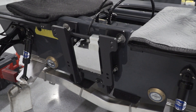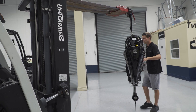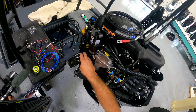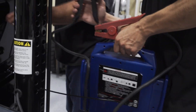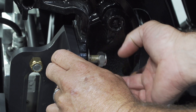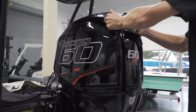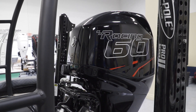Me and Brian will be installing a 60R Mercury onto this 16-foot skimmer skiff — should be a simple install and it's going to let this boat run. Now that the motor is next to the jack plate and ready to hang, one of the first steps is to hook up a battery and adjust the trim so we're nice and level with the jack plate and all of our holes will line up flat. Once we're flat with the jack plate, we insert all of our bolts and tighten it down — same as putting the jack plate on, except without the 5200. Load them up with grease on all the threads so all of our nuts will come off easily in the years to come. Now all our hardware is in, the motor is mounted, and it's ready to finish up the rigging and get it ready for a sea trial.